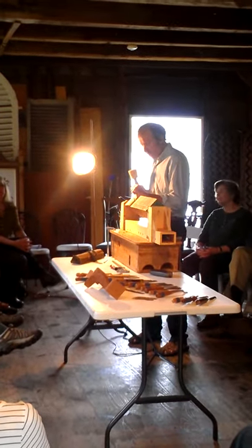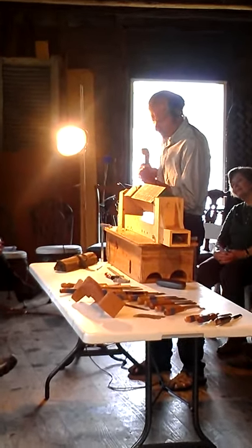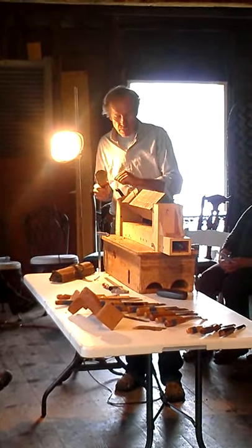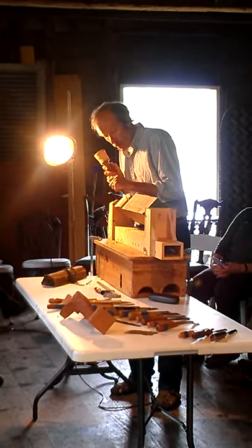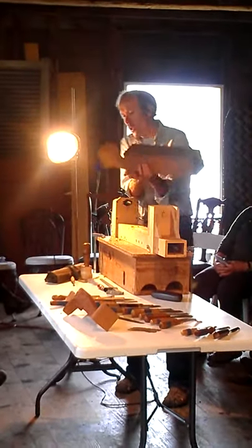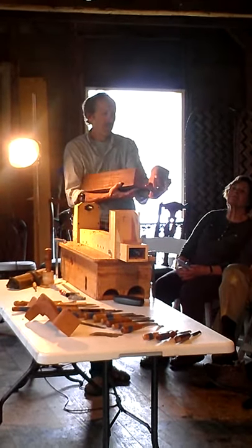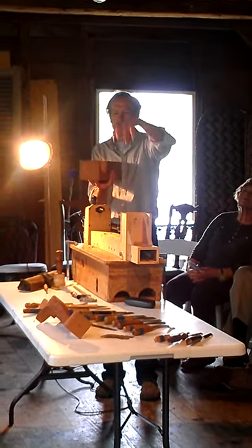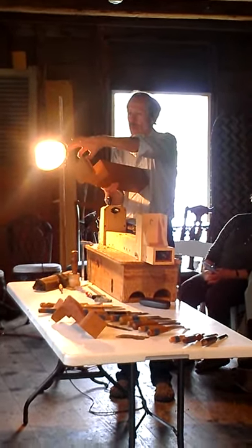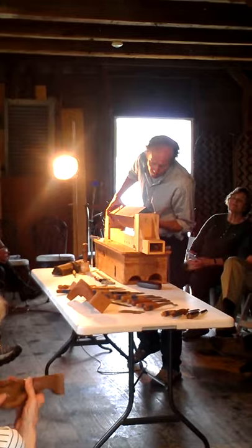What I'm doing really is I'm following this claw up the ball, and this D tool will take out a nice big slice. On the bottom of the foot here I've scribed a circle — about three and three quarters inches, almost four inches in diameter — and that circle will be the footprint where the ball actually sits on the floor. At each of these corners there's space left for the claws.